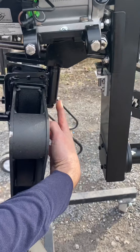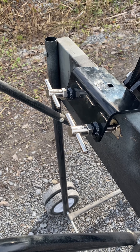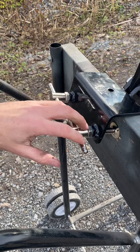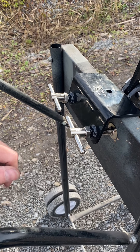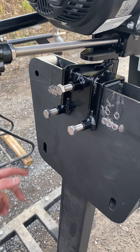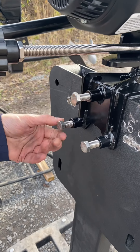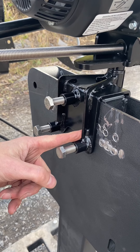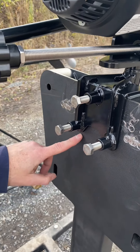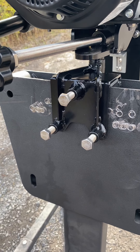The transom post bushing on the Feather Light is held on by a lock nut. Both transom mounts are fairly simple — the SE200 is tightened and loosened by turning wing bolts, with two cups that tighten right onto the transom. The Feather Light uses three stainless hex nuts requiring a wrench for first application. You'll also notice the rib reinforcement welded on the Feather Light. Its transom mount is fairly narrow with a cutaway — that cutaway accommodates a welded centerline support beam in your boat, so this surface drive mounts easily to that.